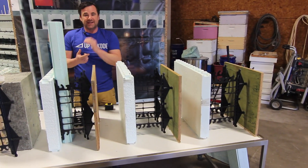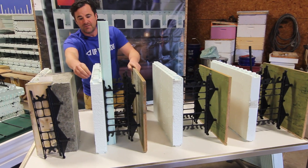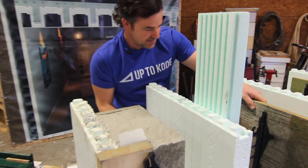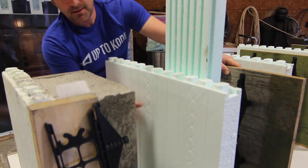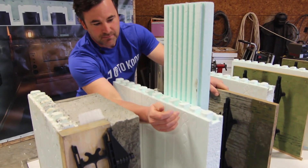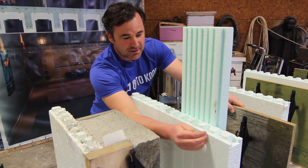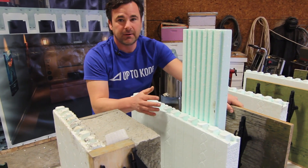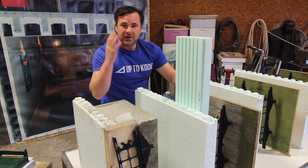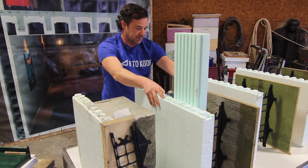What's nice about that is you can easily add the insulation — it doesn't take much labor. The snap ties, which I've mentioned in other videos, are every eight inches. You can't overlook the beauty of the system: you can attach drywall, exterior siding, anything to these ties. They're every eight inches, very easy to use. That's why this system is genius — you add insulation but you don't need to strap it out and add all these different elements and labor to the system.